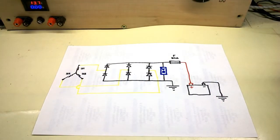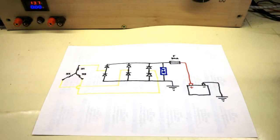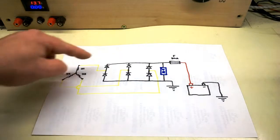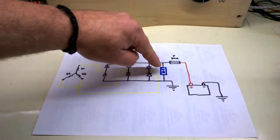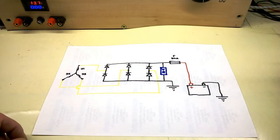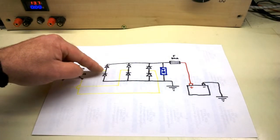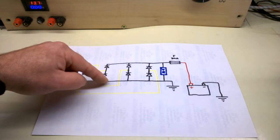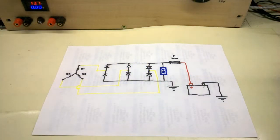Just a little addendum for those who like pictures — I like pictures. This is what I think is happening. I've drawn a little schematic. The star-shaped bit is the stator alternator — three yellow wires coming out of it giving AC at about 60 volts — going into the rectifier here, which is made up of six diodes. In operation: each of the three yellow wires goes to a pair of diodes that rectifies AC to DC, passing only the positive half, and you get your negative to ground.